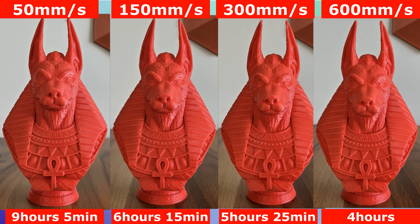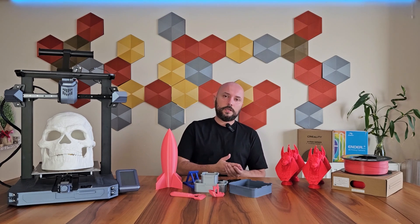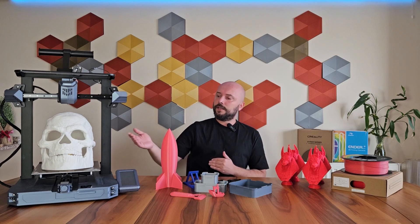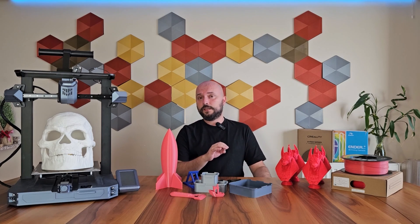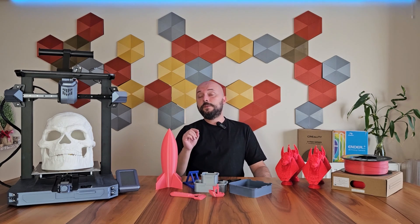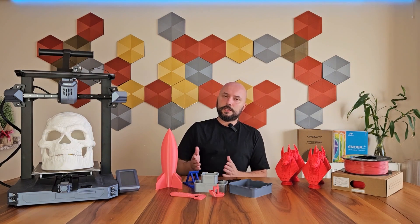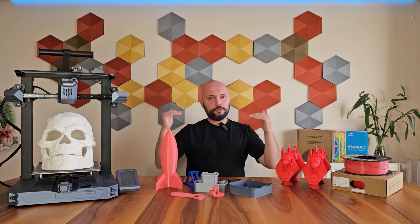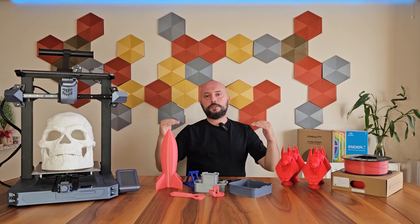While printing time significantly decreased, quality didn't drop at the same rate — the results were quite close to each other. The CR-10 SE was the first model I reviewed in Creality's open-frame fast printers, having previously reviewed models like the K1 in enclosed format. You might have a question: these printers have different classes, designs, and prices — how do they all reach 600 mm/s? One of the factors affecting printing time is speed, while another is acceleration. For example, while the K1 and K1 Max can reach an acceleration of 20,000 mm/s², this value is 8,000 mm/s² for the CR-10 SE. I can illustrate this like this: we have two cars, a Ford Focus and a Porsche 911 Turbo. Both can reach 100 km/h — let's say the Ford Focus does it in 10 seconds while the Porsche 911 Turbo does it in 3 seconds. But the speed they reach is the same.